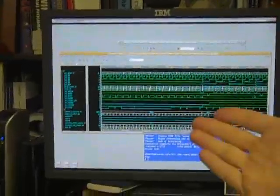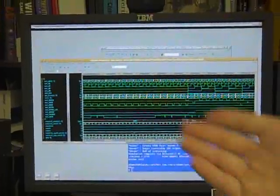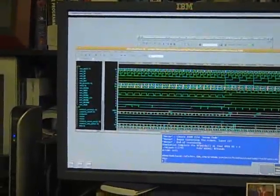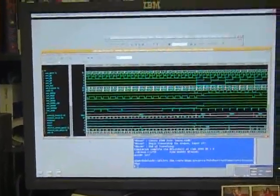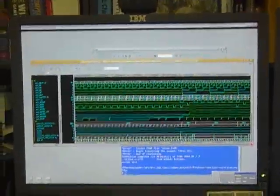So what I decided to do was take the information stored on the logic analyzer and send it over to my workstation, which is hooked up through an Ethernet cable so I can FTP onto it and grab all the data. I wrote a program to take all that data and convert it into a waveform using a standardized format called VCD, or Value Change Dump format — it's part of the Verilog standard. All you need to know is it gives me this nice picture where all the buses are compressed into single lines, making it much easier to scroll through and read.